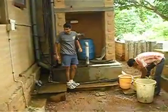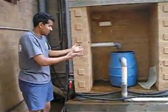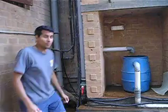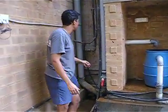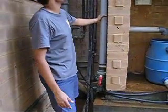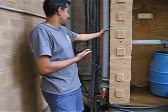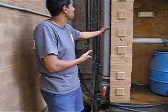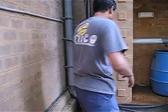Hey Anand, so it seems like you are maintaining your filter now. That's right. This is the filtration system for the entire rooftop rainwater harvesting. Let me show you guys the different components. This is the first rain separator, and essentially what it does is it catches the rain that falls in the very beginning and separates it out. Most of the dirt and stuff that comes in the first rain is separated and taken out of the system.